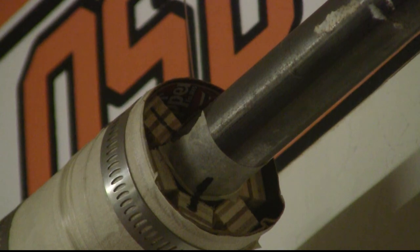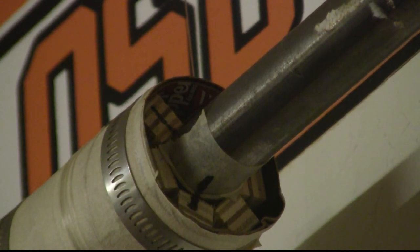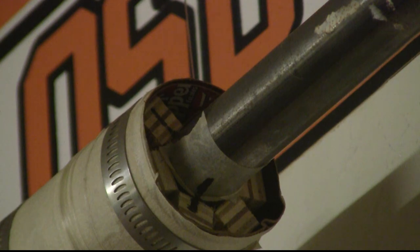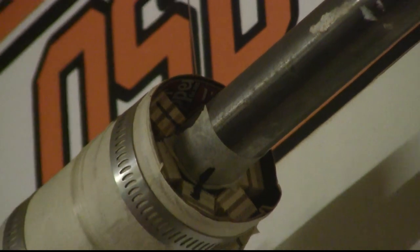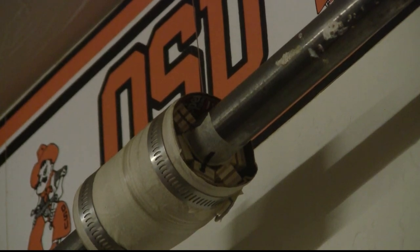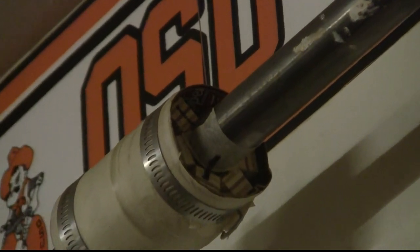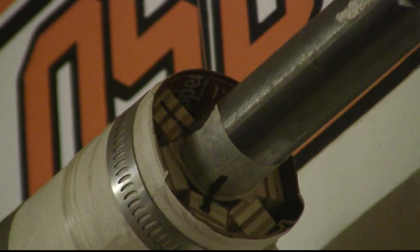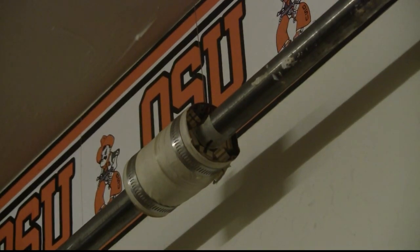You can see the plywood strips in the middle of the cylinder — they're half-inch wide as well. It turns out seven of them fit on there. Then I built those up with pieces of cardboard, layer after layer, to fine-tune the system. I put a couple of hose clamps on the end because it started to slip on me. There's also some non-slip tape on those wood pieces. I put a little mark on one of the pieces of wood and on the tape so I can tell if it has slipped — and it has not done so since I did the retrofit.